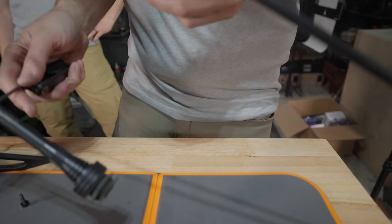Here's the crappy part, those adjustments are in the way of this. So you tighten or loosen here for the third. You tighten one and loosen the other. That's no different than how I just moved that here. I tighten one and loosen the other, and it drives it a little bit. So this is one that you could feasibly go up and shoot and move a little bit at a time until it lines up. But you're going to need a stubby wrench to get into here because it's in the way. That's the only negative about it. You're standing so close, it's hard to miss.